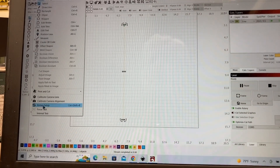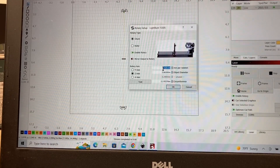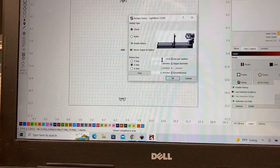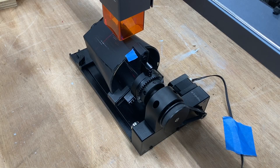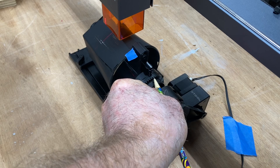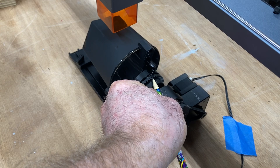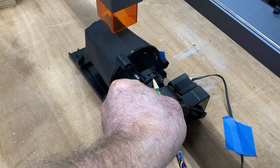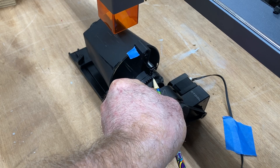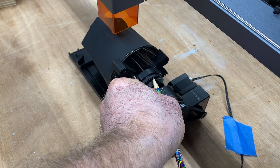Back up to Tools, down to Rotary Setup — the setting was at 1425 millimeters per rotation. I need very little adjustment, so I'm going to put it at 1435 and run it one more time. Holding my pencil on the mark and hitting Start — that's almost perfect. So I'm going to call 1435 millimeters per rotation good for this chuck.